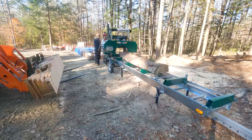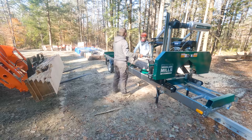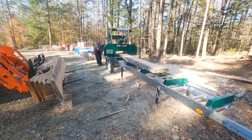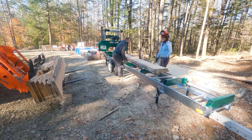Since we were cutting with the bark on the top side again — the unfinished side on top — it meant we were aiming for that bottom board to be a full two-inch slab. We've been trying a number of different ways to calibrate that so we get the bottom slab perfectly two inches, and anything over or under that amount comes off the top where it's wastage on the bark anyway. We're getting pretty good at this — it's slow, we're not perfect by any means yet, but we are learning and so far it seems to be working.